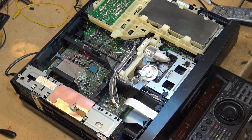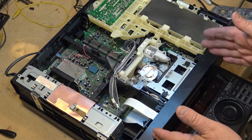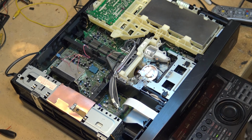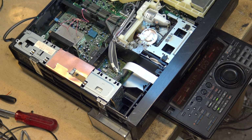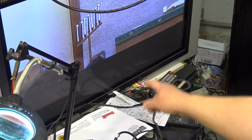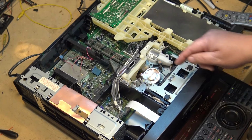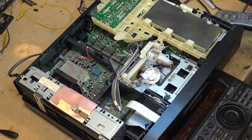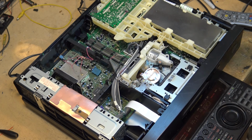Then I took the tape out of the EVS5000, put it back in this one, wound it up to the point where I wanted to do music dubbing, and used the audio dub feature right here. Press audio dub, and then I could dub in PCM. When you do audio dub, this is what would show up on the screen. It would blank out the bottom portion of the picture, because the audio is actually written after the video, so the recording circuits kicking in to record the PCM soundtrack wouldn't disrupt the picture.